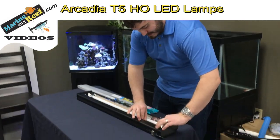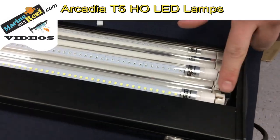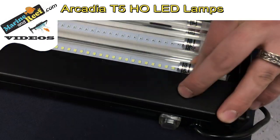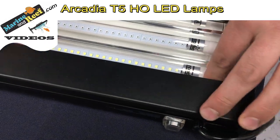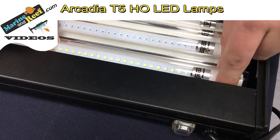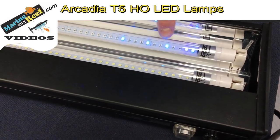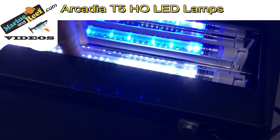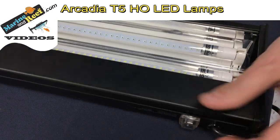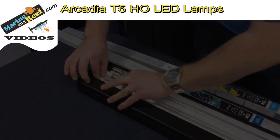What usually causes this is that one end of the fixture is loose. I actually just loosened this part here. I'm going to turn the fixture back on and you'll sometimes see that'll shut everything down or sometimes it'll just light part of it. So it's very important that these end caps make full connection. You can see when it's not complete only part of it is going to light up. That will cause some flickering. So you're going to want to make sure that all of the end caps are making a complete connection in the fixture.